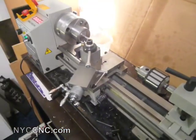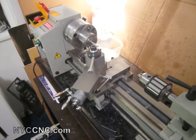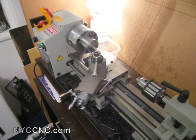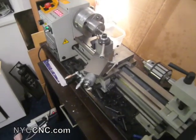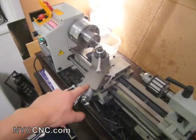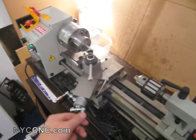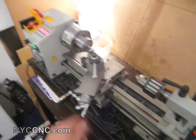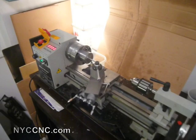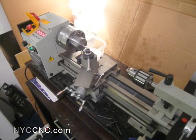This is a cam-levered compound slide lock. And this fix has been, in my opinion, a major shortcoming or just sort of annoyance to these machines, which is that normally to change the angle of the compound, you've got to back it all the way out, use a hex key to undo two socket head cap screws, move it to the angle you like, tighten it down, slide it back in. It certainly is a pain and can kind of steal your momentum when you're trying to work on a part.